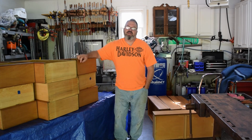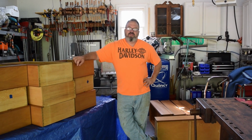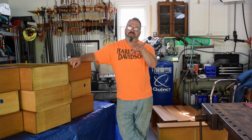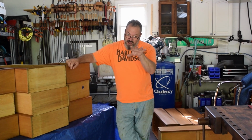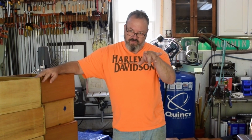Good morning. Welcome back to day 3 of refinishing this mahogany bedroom set. What I'd like to try to accomplish today is get the oxalic acid treatments done on the tops of the cases, and while those treatments are drying, we'll go through these drawers one by one and fix any chips, dings, or nicks on them. Make sure these drawers are completely ready for refinishing. Then tomorrow, when those have had a chance to dry, and I'm pointing to the cases, I'll show you in just a moment, then we can do the chips and dings on this.